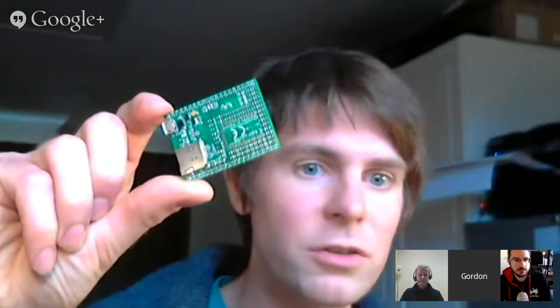Yeah, I'm really interested, especially with the Espruino Pico, in making an Arduino Shield that holds it. With existing Arduino prototype boards you could just wire it up, but it would be nice to have something pre-made. I know someone's already contributed an Arduino Shield for this one, that you can order from OSH Park, made for you on demand. So that would work really nicely. And as I said, there's already support for the CC3000 and WIZnet's WIZ Ethernet module as well.